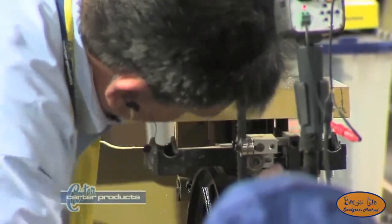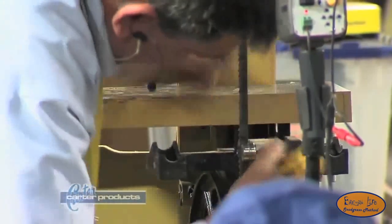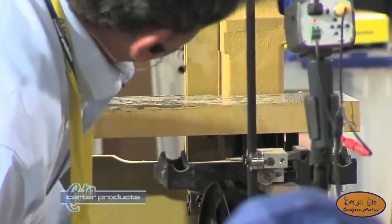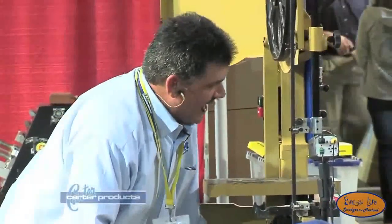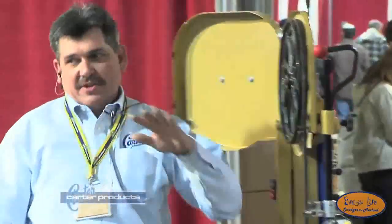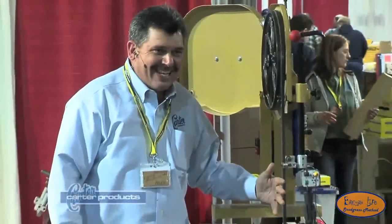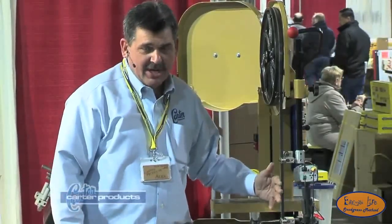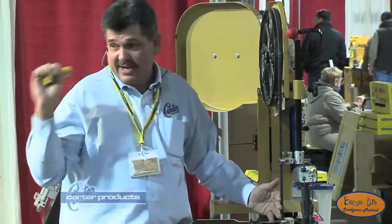Okay. Boy, this one is just being a little bit obstinate today. All right. Now, we've got this set up to where neither of those bearings are turning. But y'all know that this does not feel real good on the back of my fingers, those sharp points. I should be able to put the slightest amount of pressure on there to make that bearing turn. So close that it looks like it's going to touch, but it doesn't.